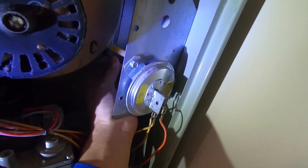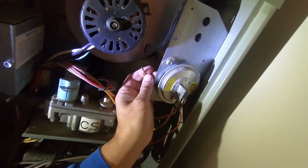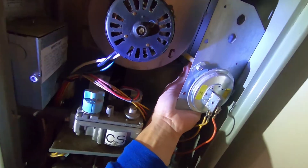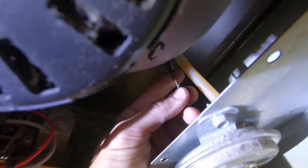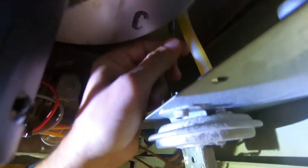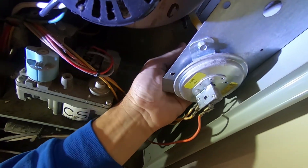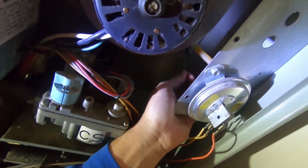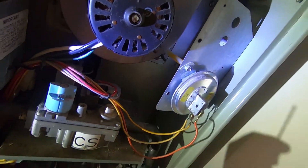You should feel suction through there, which we're not. So what I'm gonna do is take a small drill bit close to the same diameter and try to push it through there and twist to get anything that might be building up in there out. All that is clear now. Sometimes you'll get a little condensation build up there during the summer months and it'll close this off and cause it not to work properly. So now we've got that cleared out.